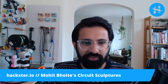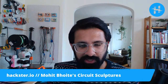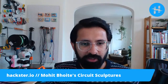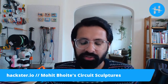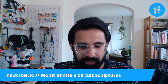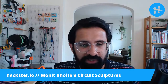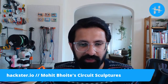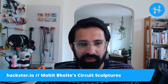at one-to-one scale. And if it's three-dimensional, then you chop it down into layers, because on a PCB you can have multiple layers, but you can explode that onto a sculpture. If you go layer by layer, still designing PCBs, we can achieve the precision. I do use Adobe Illustrator or Fusion 360 or Eagle CAD, or simple pen and paper on graph paper works fine too. But yeah, a lot of sketching beforehand. Then I also like to first breadboard the circuit, to make sure it works properly, and then go on to the final sculpture.